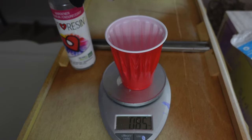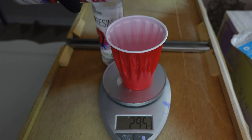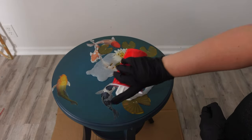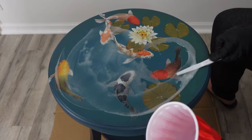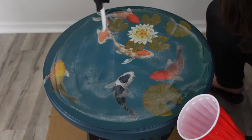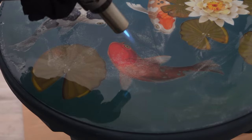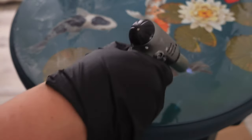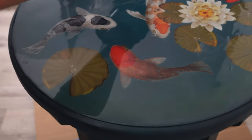For the icing on the cake, my last step is to do a resin pour. I'm using Art Resin with a 50-50 mix. I'm not going to use a lot because I don't want it pouring over the edges. I mix it for around three minutes to make sure it's completely mixed, then pour it on the piece and use a little plastic spatula to bring it out to the edges — I want to keep the lip with no resin on it. Any bits that spill over I just wipe up quickly. For all those bubbles, I blow them out with a blowtorch, spending about 15 minutes blowing out bubbles and adding a tiny bit more resin where I see small divots or little holes.